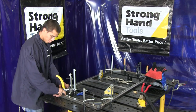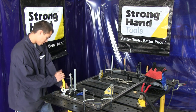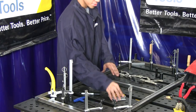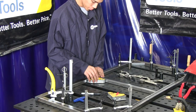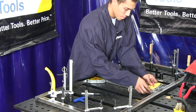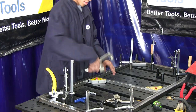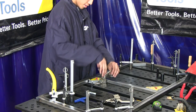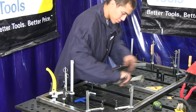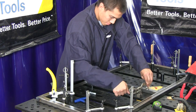To weld the support bars in, I'm going to use the insert clamp with a ratchet on it — I need it to hold really tight. For the center support bar, I'm going to use the adjusto magnet to hold these in place and make sure it's square, with the on and off switch. And to hold the center bar down to prevent it from warping, I'm going to use the table mount seat clamps. Then you adjust it from the back.